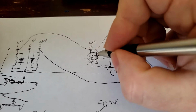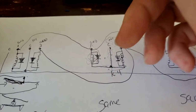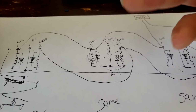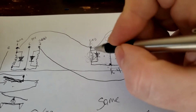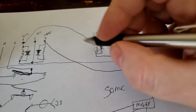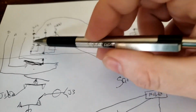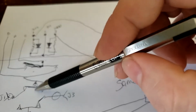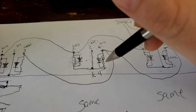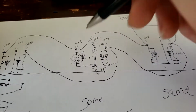However, during that period in time when the polarity changes, the voltage across that coil is going to have an instantaneous accumulation. It's going to spike. It may even potentially double. So when that occurs, that instantaneous spike in voltage could be what's causing damage to your contacts, right? There's several contacts, especially because you have indicators. These could be damaged, so that could be one reason why it's not switching over after a little bit of age, because of that flyback voltage.